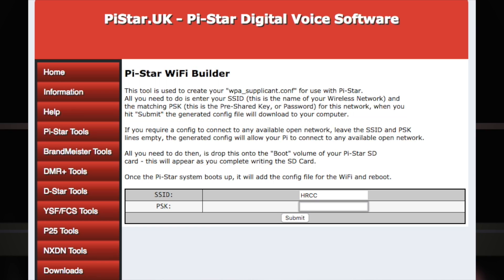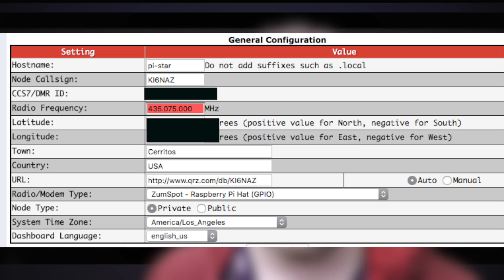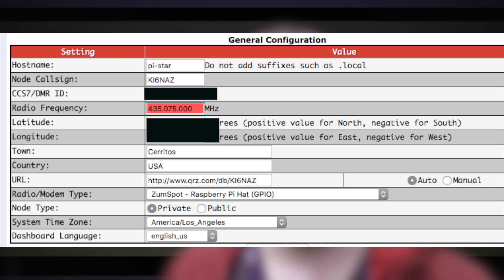The PiStar menu is straightforward for setting up a network adapter — you just click on the Wi-Fi signals it sees and provide your password. My preferred option is to use the PiStar website Wi-Fi tool to create a file you drag and drop onto the boot image on the SD card. How you interface with the radio is similar to a repeater — you configure a frequency on the ZoomSpot and program that into your radio, creating contacts with whichever talk groups you want. I have programming videos in the description for DMR radios.